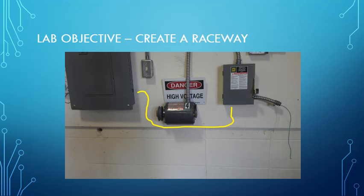What makes this difficult is because the guide that you see above only discusses how to make these 90-degree bends in the take-up from the end point. You subtract your take-up from the overall distance coming up, and that's where you start your bend. But it doesn't discuss what to do when you have something in the center that you have to subtract from. In that case, you have to find out the total linear inches that are consumed during each of these bends and in between, so that you can see how long your pipe is going to have to be.